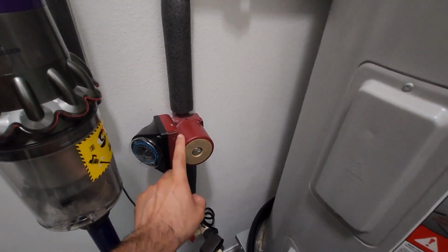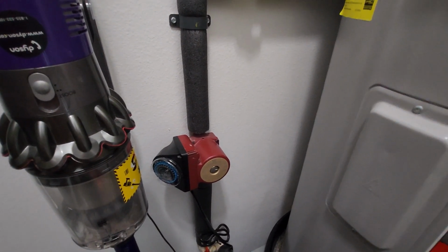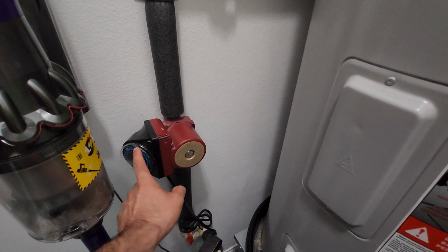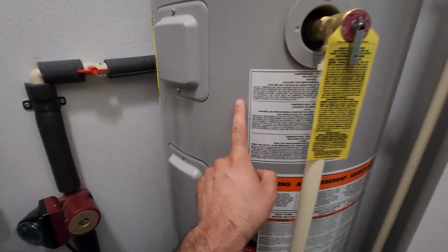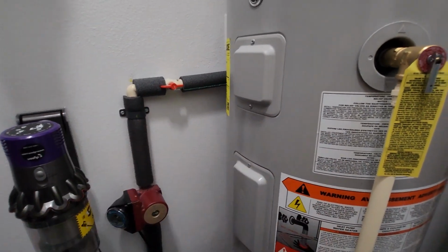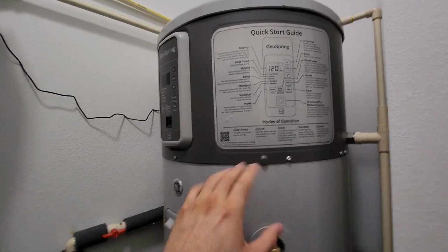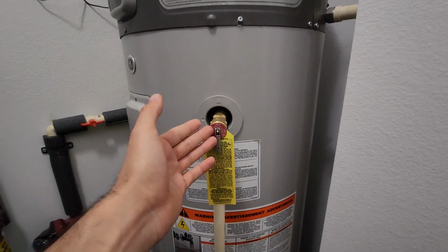And this being activated, usually I would run it throughout the day, once every hour. That way you always had hot water when you opened up the tap, right? But ultimately, this added a lot of pressure because you're constantly sending the hot water away while this is creating the hot water, and then it has to replace the hot water. So it just constantly builds up this pressure and it never gets proper relief. It's always thinking, oh, I'm out of hot water, I got to keep making hot water. So this endless cycle, and then that causes it to drip.